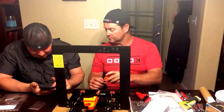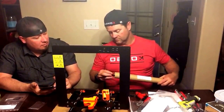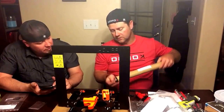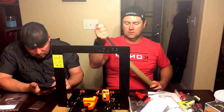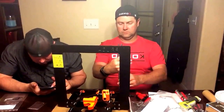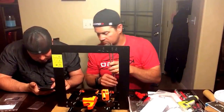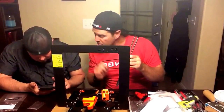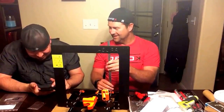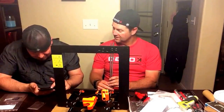Alright, now what? M3 by 18 place. You need the long, smooth bearing rods. The longest two. Alright, so you take these back out, and the 3 bearings. Take the 2 longest and put in your bearings. Now, please be very careful. Gently insert the rods into the bearings. This should have said gently earlier. We probably glazed over it because you're like, hurry up!